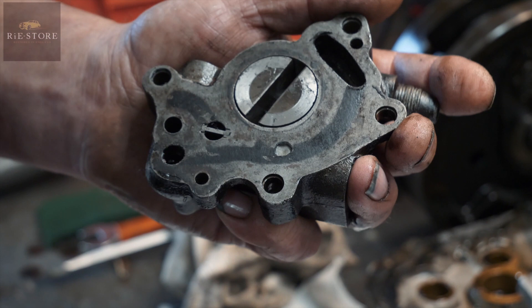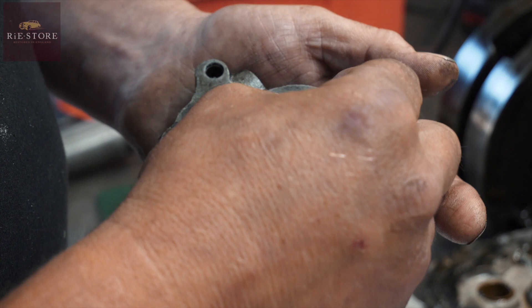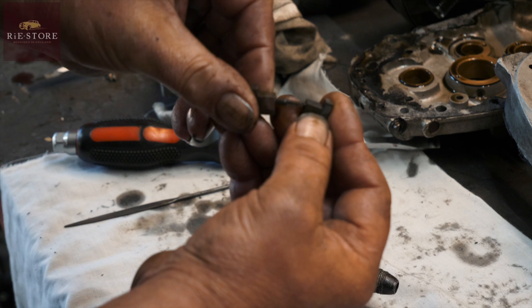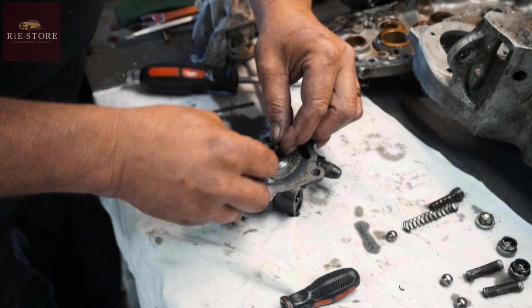As those teeth go round in the vane, see that tooth? It's basically sticking up more — it's forced outwards by your spring in the middle. So you've got one going that way and one going that way. They both face outwards; it doesn't matter which way they go. So if you put one on the other it's the same way round. So that's your basic pump rotor.